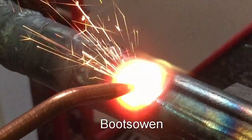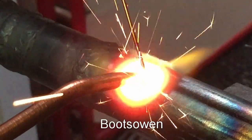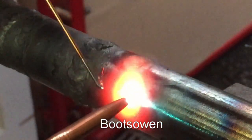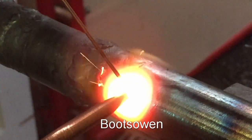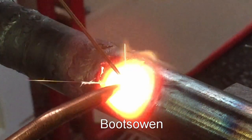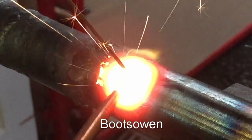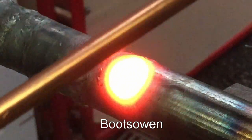There's a bit of contamination in there because that was where I joined one filler rod end to another. I've gone a bit stray — I'm starting to come over at a bit of an angle here. If you were welding a cut pipe of course this wouldn't be an issue — you'd have a line to follow. I wouldn't be going all off to one side.